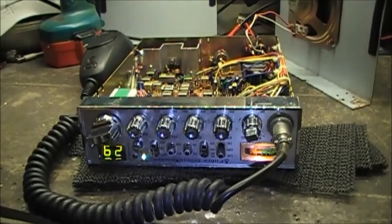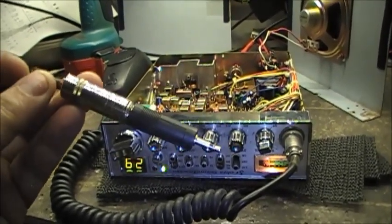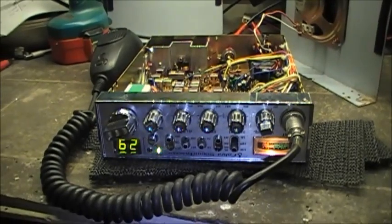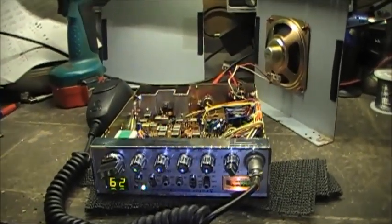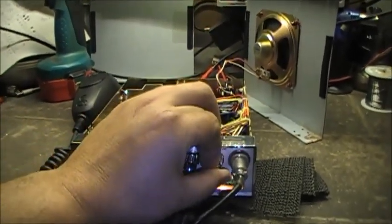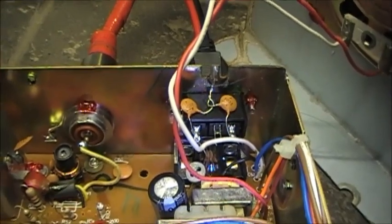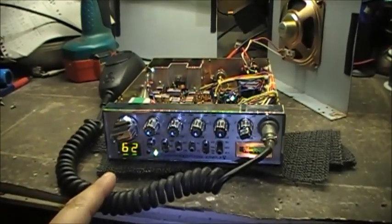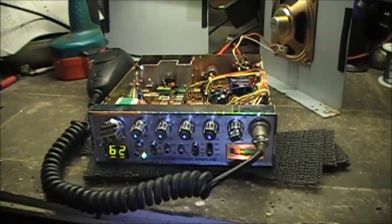During the video I had the radio running on an external speaker hidden up here, so it was on an external speaker. The reason it's on an external speaker is because there's no sound from the internal speaker. So we know we have audio to the external speaker — check — but nothing from the board to the internal speaker. This particular Cobra 29LTDST was made in China, according to the sticker on the back of the radio.